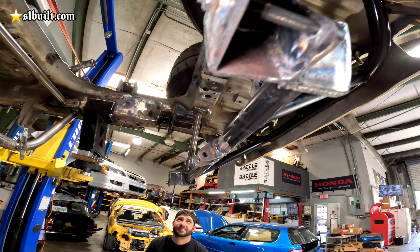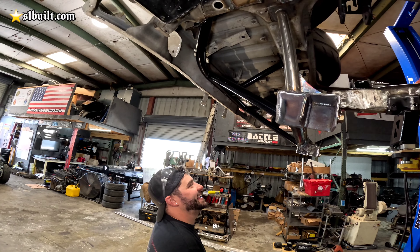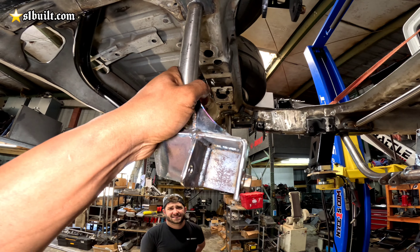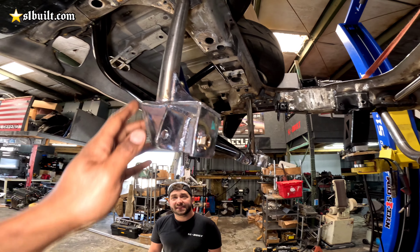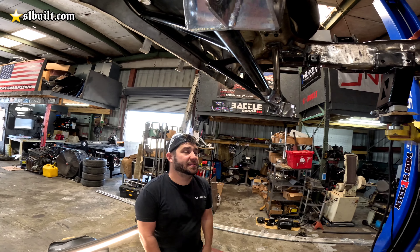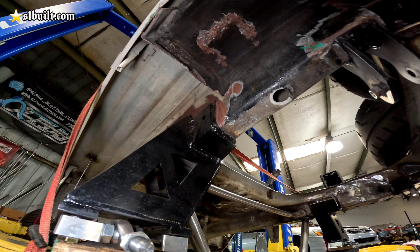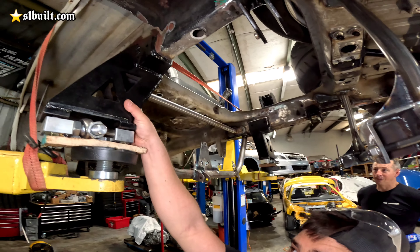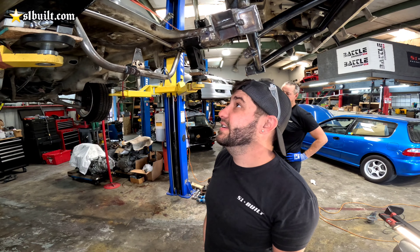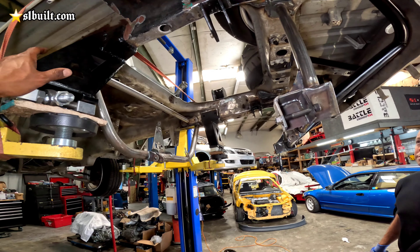Screenshot it — we don't hide secrets. You could duplicate it just like this. Patent pending! That was really just to structurally support the bottom of the arm. The frame's all good guys — all the cutting and everything, the frame's pretty nice. This is pretty robust, I don't think this is going anywhere. This is eighth inch steel plating all the way around with eighth inch steel gusseting around the frame, so this piece is pretty solid.